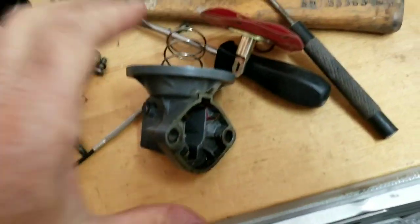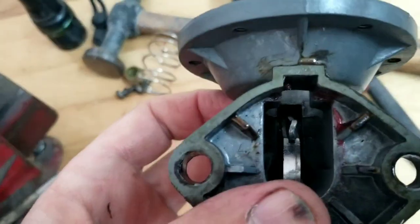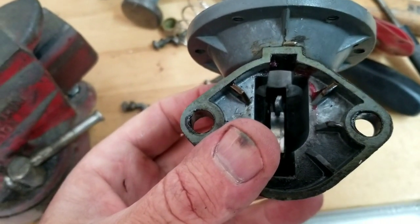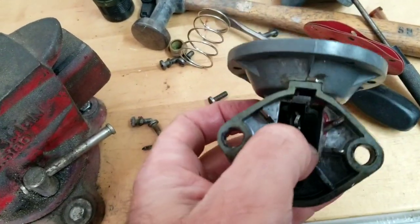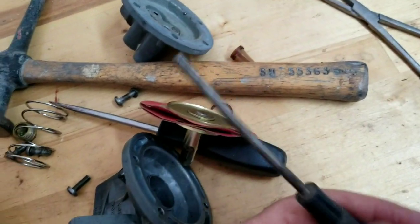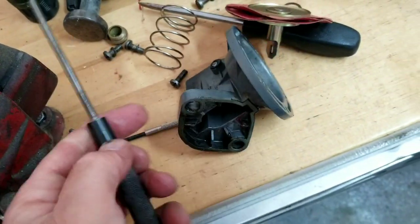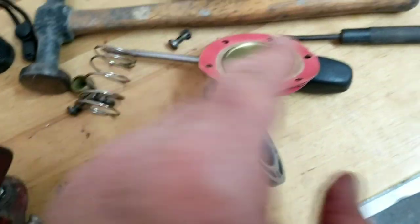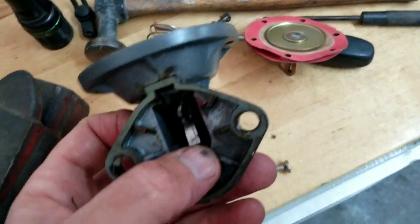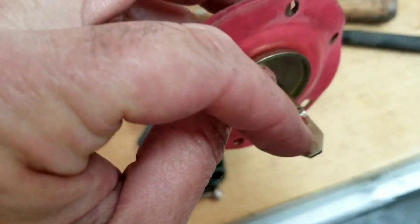This is actually a little bit harder than I thought. To get the pin in, you have to use both parts at the same time. What I did was use one of these punches from Harbor Freight Tools, pushed this in with my thumb to hold it in place, pushed this smaller punch in there to get it in place, and then used the pin to push the punch back out. What I realized - having never had one of these apart - is that this thing actually hooks on that pin right there.